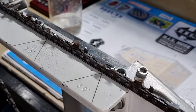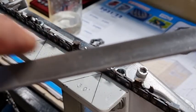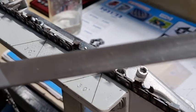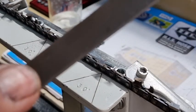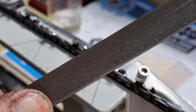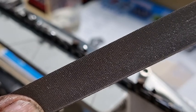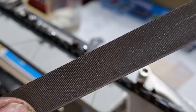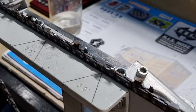One of the reasons a file goes blunt - it's got very little sharp edges on it, and those little sharp edges, if you look under a very powerful magnifying glass, those little knife edges that are all on there start to chip off. When you go up in hardness you'll find that metal becomes much more brittle, and that's why what happens to a file - all those little sharp edges start chipping off because of the hardness. I hope that explains it a little bit.